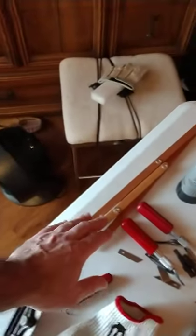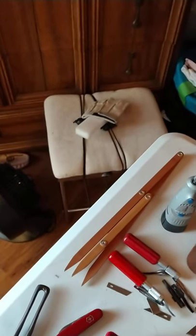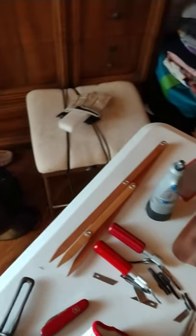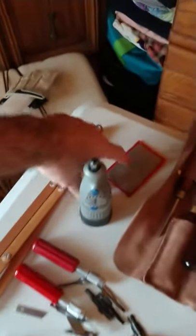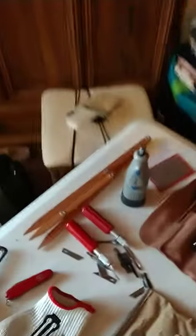Another tip for anyone who's new to wood carving or wood carving tools: don't buy anything made from stainless steel. Make sure you've got good carbon steel. Carbon steel can be hardened. Stainless steel, don't use that. But a pocket knife — this is stainless steel — but a pocket knife comes in handy. Fibonacci calipers. I'm not a firm believer in the Fibonacci sequence. I'm just not sold on it, but I will use it occasionally for reference. I've got a diamond plate that I use for sharpening. Also got an electric sharpening tool that I'm not going to show in this video.